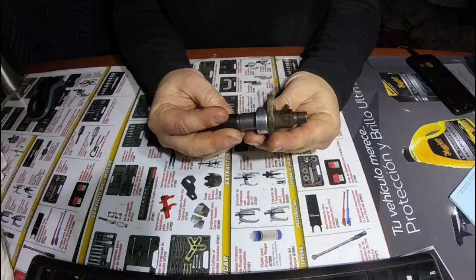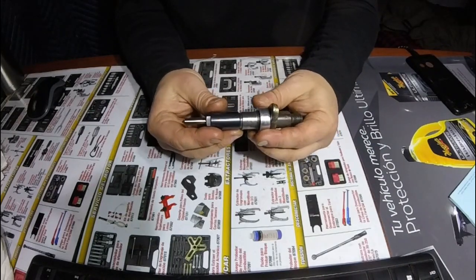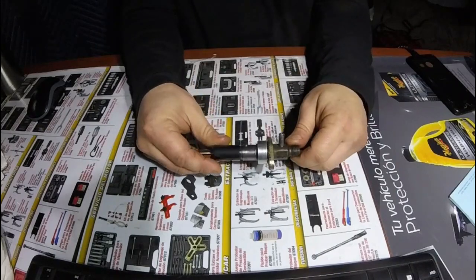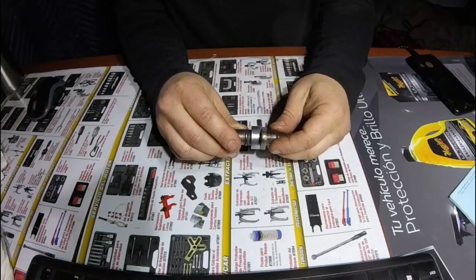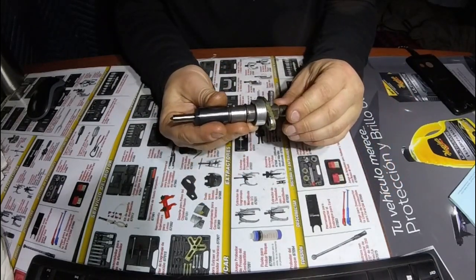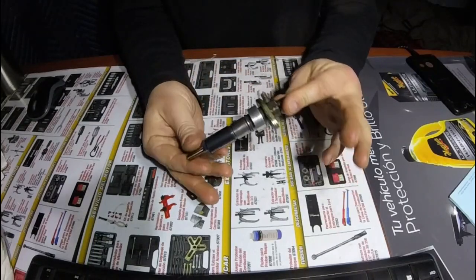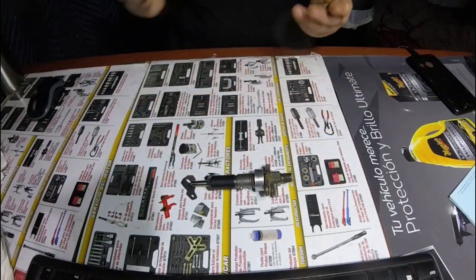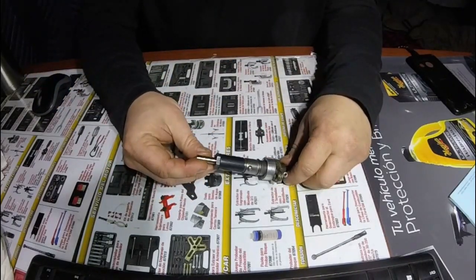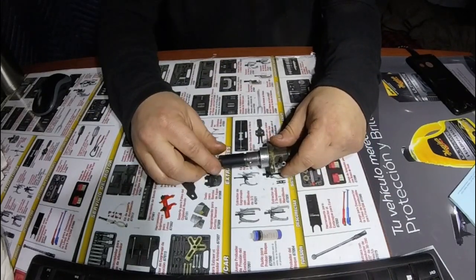Hopefully you enjoyed that and found it informative. Of course, this really only applies to this style of injector. When you get into mechanical unit injectors, hydraulic electric unit injectors, or common rails, you can throw most of this out the window — there are some similarities, but they don't work the same. This is really the only one that operates off of pressure going straight into it like this. Indirect injected engines also work similarly but at lower pressures and don't look the same on the end. Really simple design — and that's probably how it can be $20 if I need to replace it, even at that kind of quality. It's actually a very nice machined assembly. Anyway, I'll see you next time.